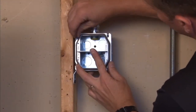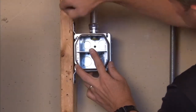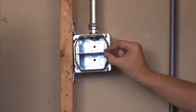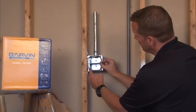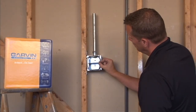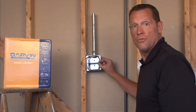You then screw on the cover by reattaching the screw and snap off at the desired depth of the plaster ring that you're utilizing. Now you have separated low voltage from high voltage, or vice versa, thereby preventing any interference between the high voltage and the low voltage.